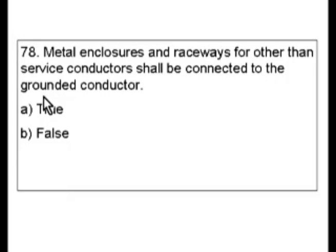One thing you should know: there's a grounded conductor and a grounding conductor. The grounded conductor is the neutral. How I remember this — when it has the suffix '-ed' added, that's like a past event, meaning something has happened to it, so that conductor has been grounded. When '-ing' is the suffix, like grounding, that means it's doing something — so that conductor is doing the grounding.